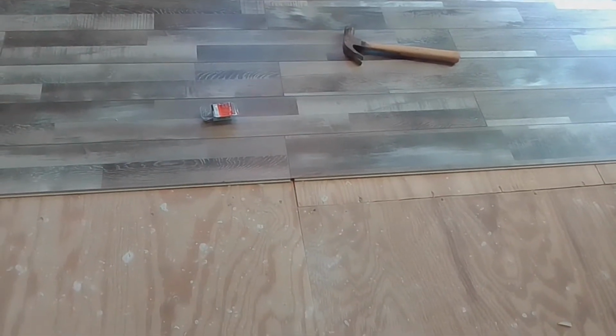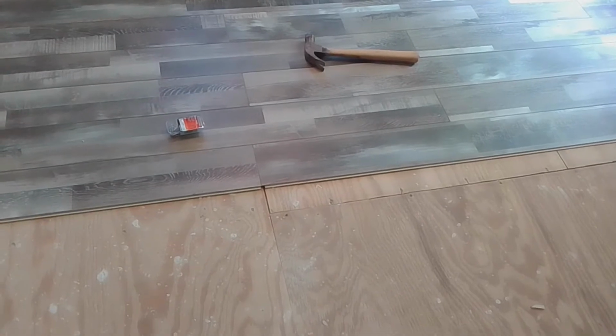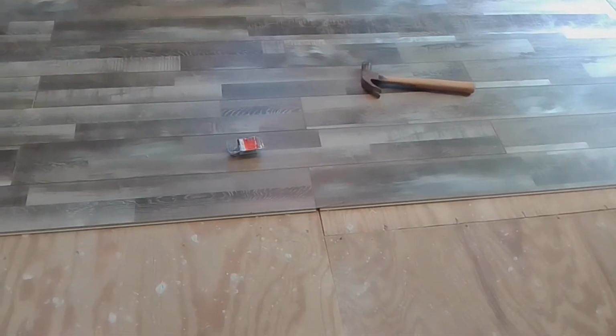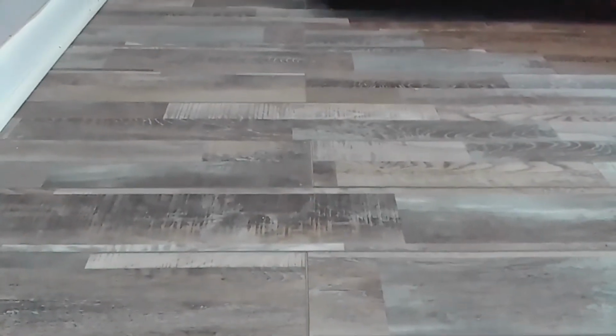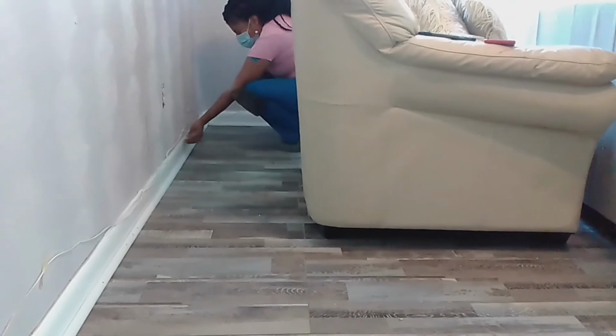On top of plywood, we use wire nails and glue in a very, very small quantity. You honestly can't even see the nails on a casual walkthrough. But there are a few in the floor. Probably every other row has a couple of nails in it to make sure that the floor is nice and secure and does not shift. You can barely tell. And the furniture is able to slide across the floor accordingly because of the nails and glue.